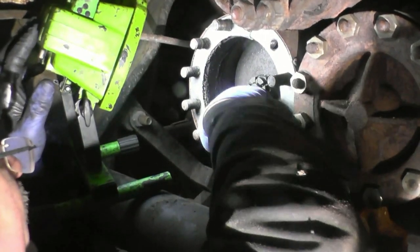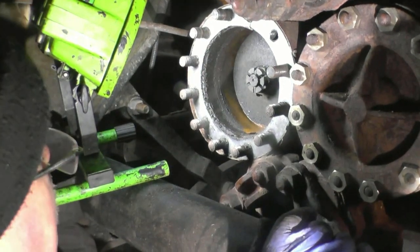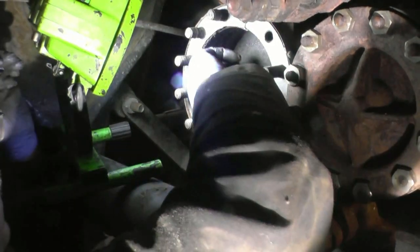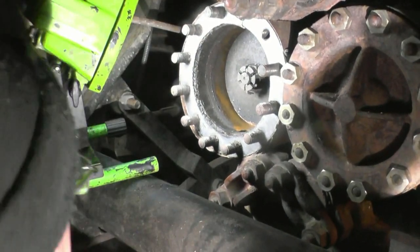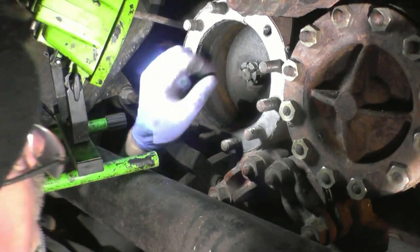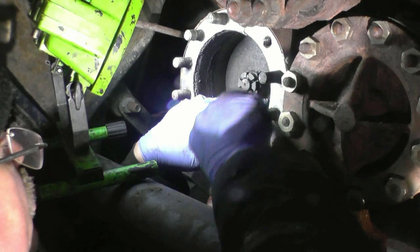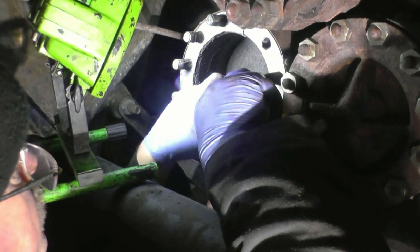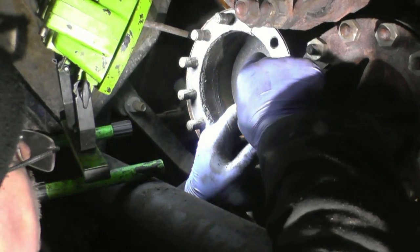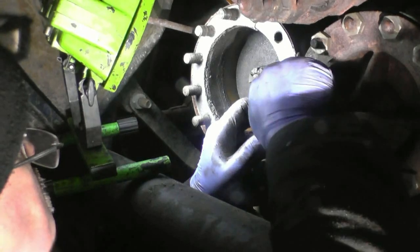Look at that, see the film of rust there? It doesn't do steam engines any good. Standing still. Definitely not. Right, I really need a pair of pliers. So the idea is split pin, big nut, and then... Fortunately, there's no Woodruff key or tab lock on the piston. Leave the piston up this end.